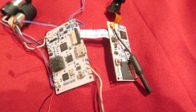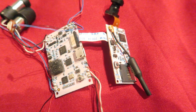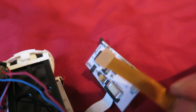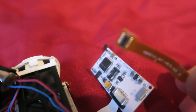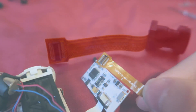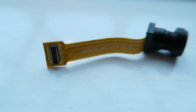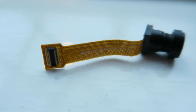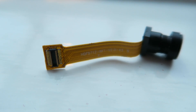On the past model these ribbon connectors were notorious for burning out due to too much current. We have to be so careful with this tiny camera — the ribbon cable is really long and just a few bends and it will stop working. The ribbon cable detaches really nicely; however, at present there are no spare parts, so modifying the lens is a really risky job. I have plenty of quads though, and the blurriness of the camera makes this unusable in my opinion, so I feel I don't have much to lose.